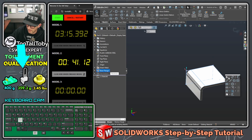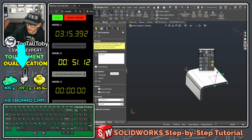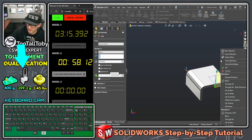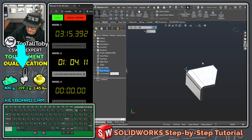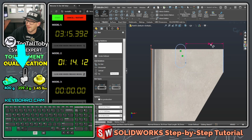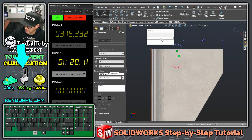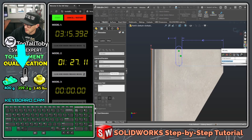Now I'm going to get rid of this front corner area. I know we could do that with a chamfer, but if it's not a 45-degree chamfer I'll often just make it as a cut extrude, especially if it's just one. If it were multiple chamfers I'd consider the chamfer feature, but for just one here I'd sketch up that triangle and cut extrude it — linked to thickness for the depth. Then I'd create the sketch for the bend relief. You could combine those two sketches, but keeping features separate makes them easier to edit and troubleshoot. For this one, hold shift, pick on the tip of this arc, and make that go out to 16.